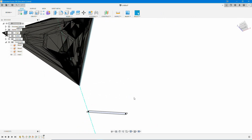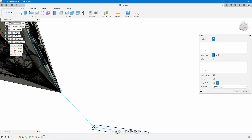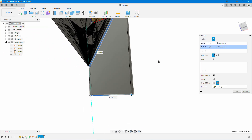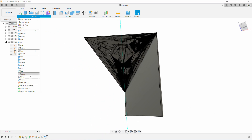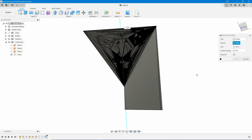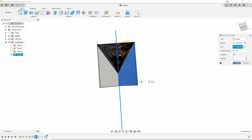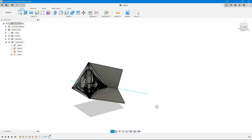Now we're going to take a look, make sure everything's clean and lined up. We're going to go to Create Loft, then select the first profile — the dice edge — and select the Build Plate, and there is the first fin support. Once we have this set, it's super easy to create the rest. We're just going to Create Pattern, Circular Pattern. Make sure this is set to Bodies — sometimes it'll default to Faces. For Object Select, click and drag from right to left in Fusion, and that will select the whole first fin. Then select the axis we made, and just like that we have a fully supported D4 with fin supports. Much quicker and easier than attempting to do this in your slicer.